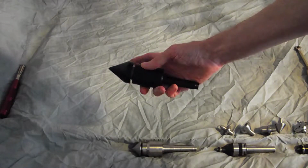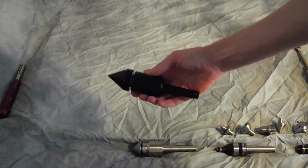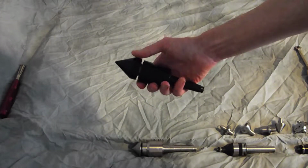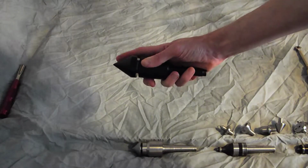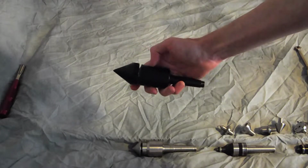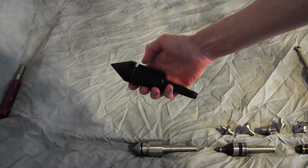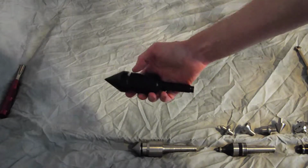The bearings are smooth as silk. It's quite weighty, it's got to weigh a pound, maybe a pound and a half, easy. The 60-degree cone comes off, and you're left with the cup centre like what is on the One Way. As I say, it came free with the lathe, it's a brilliant live centre.